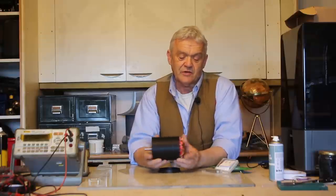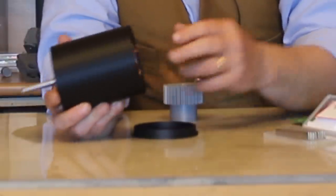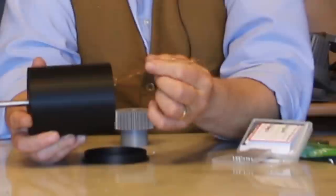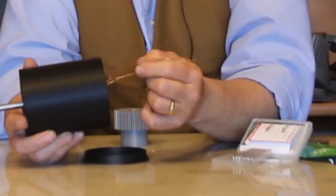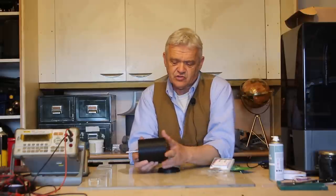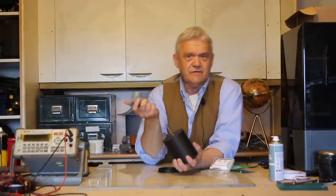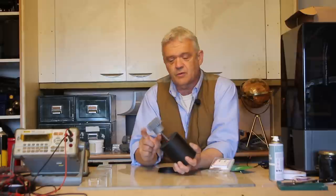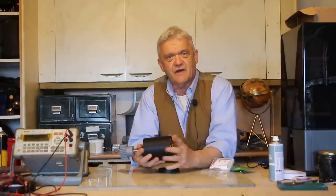Full details are in video 1931, but it is basically three serpentine coils arranged around a bunch of neodymium magnets, and we have six exit wires. So we need to rectify what's coming out of there, put it under load, and give it a test. To do that I've got this massive chunky cog that I'm going to put onto there along with the rectifiers.